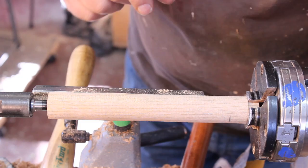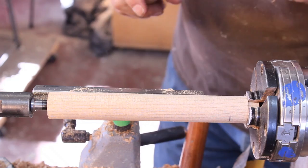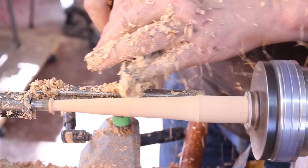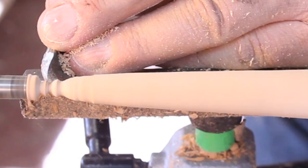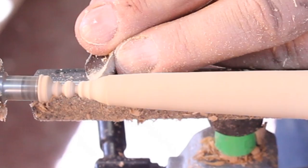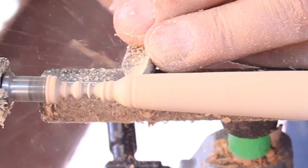Now I'll be using some different tools. I like this size of spindle roughing gouge — I got this from Packard. I'm going to develop kind of a taper along here. What I'm mainly trying to accomplish is to simply thin this down with the tail center still in place, and this will allow me to turn with a spindle gouge and do my finial with the tail stock removed. Now I'm starting to profile the very end of my finial with the spindle gouge, establishing a little bit of a sphere shape, with the tail stock still there for support. In a bit I'll remove it and will probably have to back that up with my hand to prevent a catch or vibration.